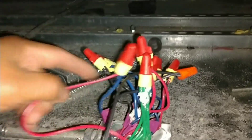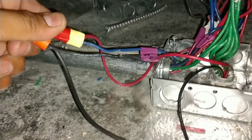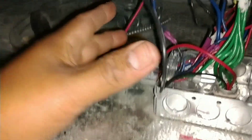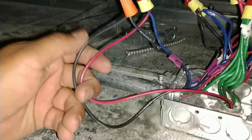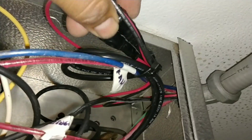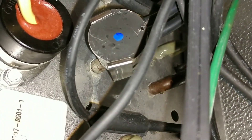So this is on top of the box. If you notice these two wires coming from the condensing unit that are not being utilized right here - what we're going to do is tie them in. Black is black and blue is red. This is going to be our neutral and our termination. Remember, we have a couple of circuits, so once we go to the condensing unit it'll all make sense. Those two wires we fished in are going into this - we had to add that defrost termination right there. It's going to open up at 55 degrees.